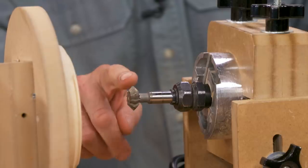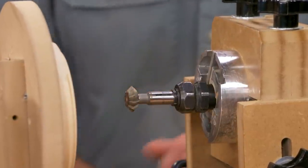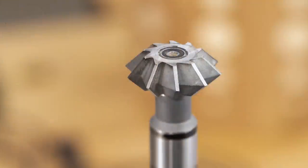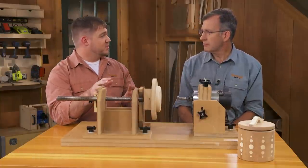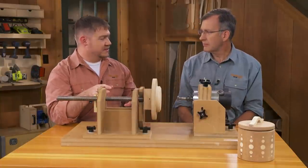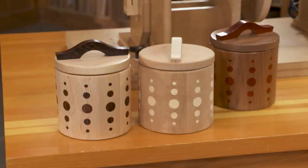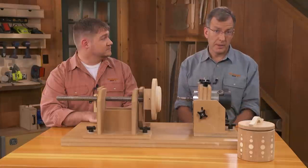The heart of this is a 90-degree double-bevel metal cutting bit — but it works great for cutting wooden threads. It has very little rake to the teeth, so it makes a beautiful, smooth cut. One thing that's really cool is you can cut threads on projects of almost any size on this thing — as long as you can hold it to the platen, you can cut threads. It doesn't matter if it's our smaller canisters; you can go bigger or smaller with them. You can go teeny tiny, or if you redesign the jig, you can make a canister that big.